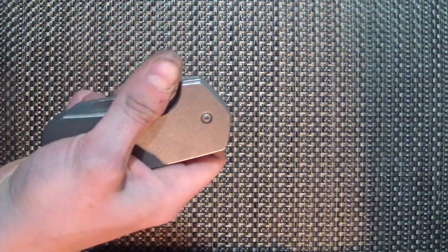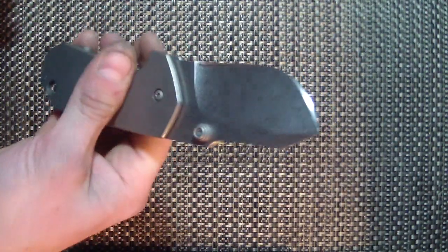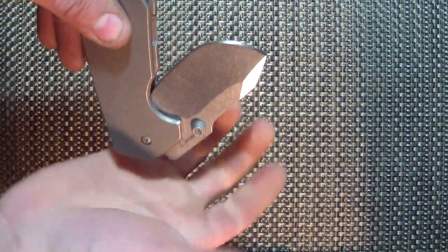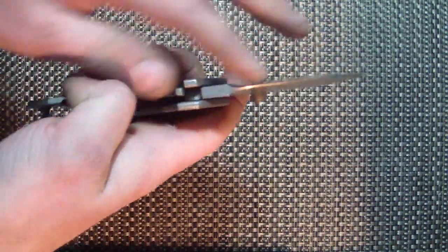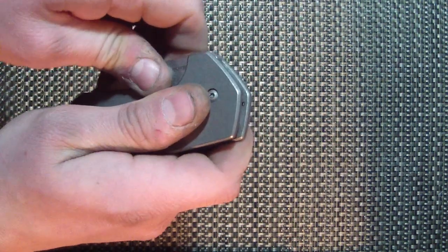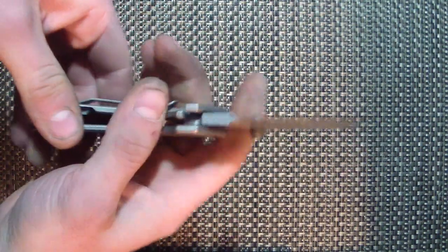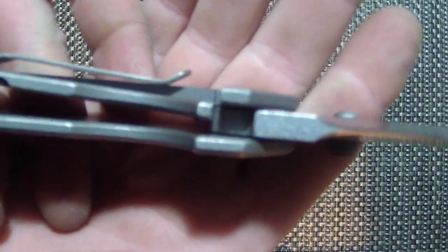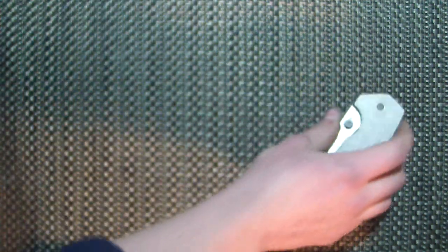This thing is rock solid now. I had really bad blade play — it would go clickety-clack, the worst possible thing ever. But I figured out a fix. It's a little harder to open now, the detent is really hard sometimes. I pushed the lock bar inward, carbonized the bottom of the tang, carbonized the lock bar, and now it's rock solid with no blade play whatsoever. I'm happy with it. It's not worth waiting two months for a new one and potentially having the same issue.